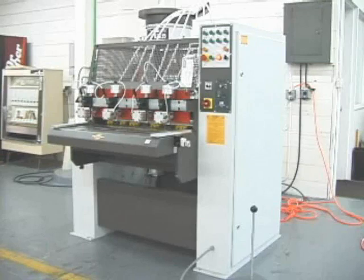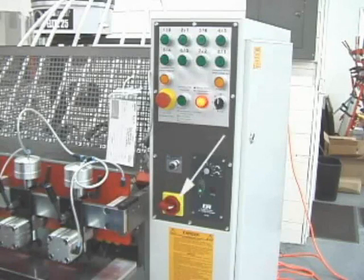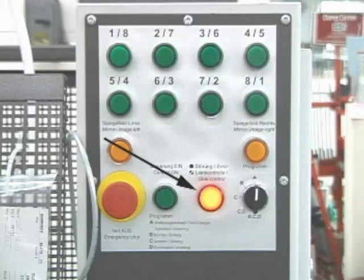At the far right side of the Elite is a consolidated control panel. This panel consists of a main on/off switch, the glue potentiometer, and the hopper feed on/off switch and adjustment. On the upper panel is the emergency stop button. Next to this is a control panel on switch, which illuminates green when the machine is ready. To the right is the low glue warning light, which flashes red when the glue volume is below one liter, or constant red when the machine is in standby mode or has a malfunction.